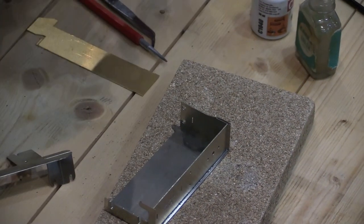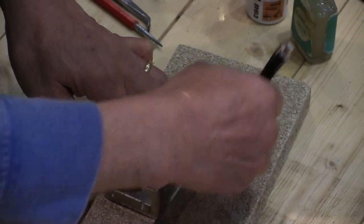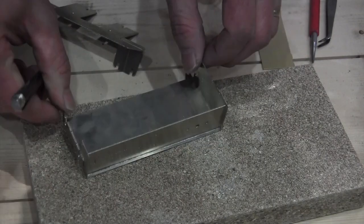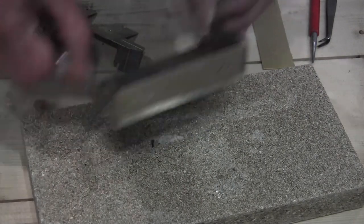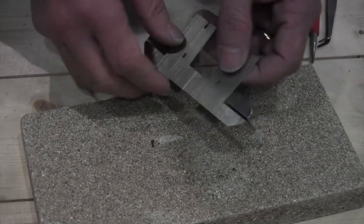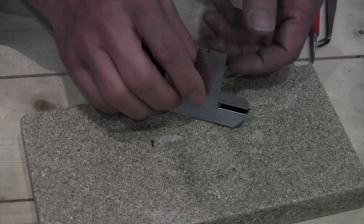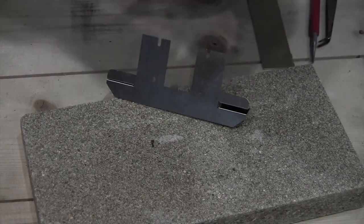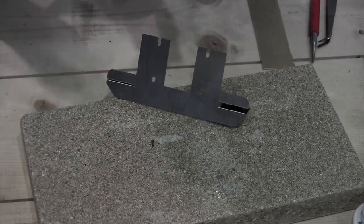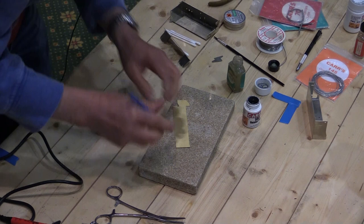Okay, and with a fiberglass pencil, that will clean up an absolute treat. Might have to go along with the trusty chisel just to get a couple of lumps off, but in general, you get a nice neat joint. Okay, sweating then, what that is where you put solder between two pieces of flat plate that you want to join together. And actually the best way of sweating a joint is, rather than the conventional way where you tin each piece, okay? So tinning, let's do a bit of tinning to start with.